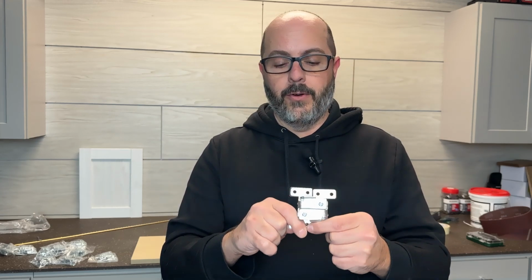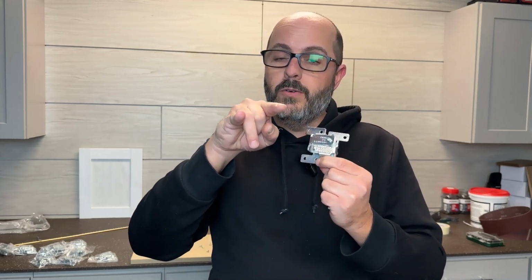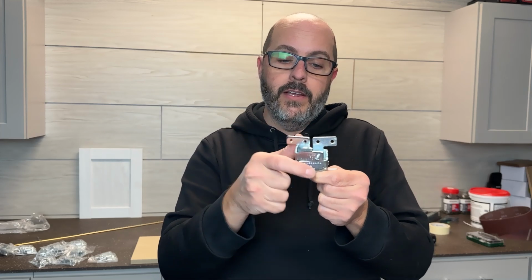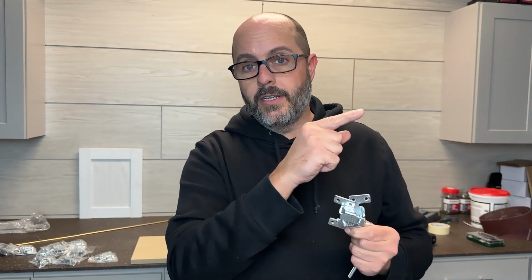So say you're together right here, this is bolted. You can use these little things to fine tune the two pieces of, let's say, countertop when you're joining them together, level them out, then you tighten this bolt and nut, get it all nice and secure, and that thing is ready to rock. Let me show you.